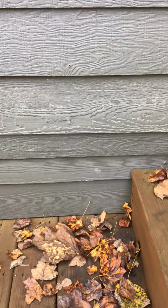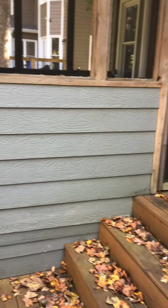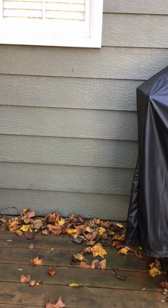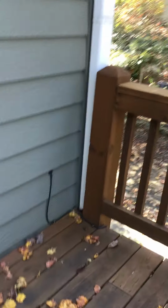And then when you come up on like this, if you look closely on the edge of his side right here, see where it's chipping and delaminating? In another year, that'll literally fall apart. So we'll replace this section of siding right here with Hardy Plank, this little piece right here in the corner. And I hate to do it to them. We were initially at 3 rows on the back here because it's chipping, and you can see it in here. And I'll pick a piece where I have to go back to the chimney side, or probably right over here. To the right side of the door, we got 3 rows right here.